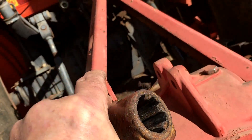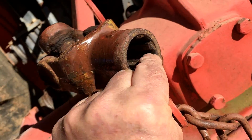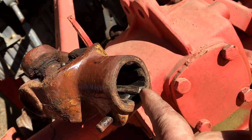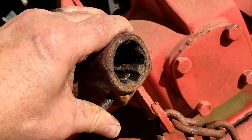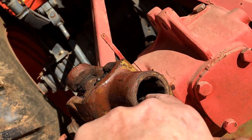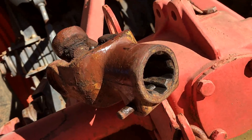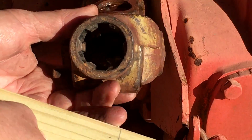I've got it out in the light now and you can see how rusty it does get up in there. I've scraped it off pretty good. You want to be careful of this little pin that holds it in - you don't want to file that down. File the grooves, the upraised parts, the tops and the bottoms. Just do a little filing, you don't have to go crazy with it, and it will slide on good and easy. Make sure you've got some grease in it.